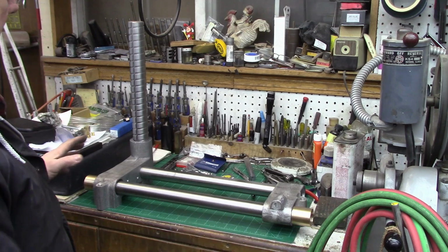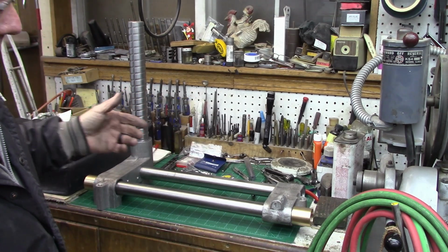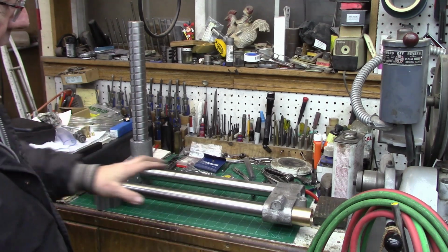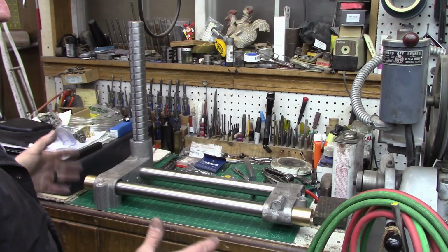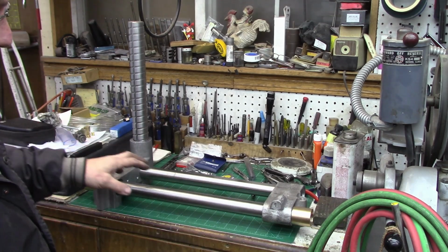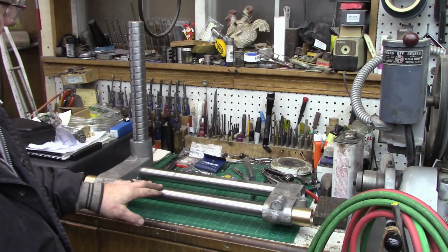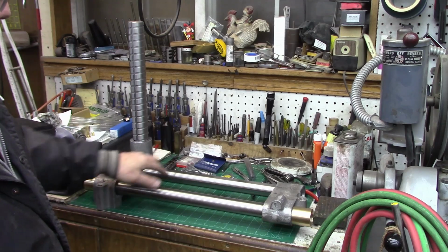When we epoxy them in place, we'll set them up the way Chaddock originally designed it, to level out the bed and everything. We'll just lay it across a surface plate and do it. With these bores being oversized for our bushings, when I epoxy them in place, that'll allow this to float and make sure I've got alignment. Now I've got a real tight fit on these shafts, so I'm going to go back and lap them down to size for a nice sliding fit. Then we'll just clean up this last one.